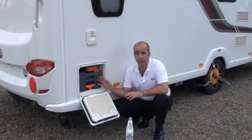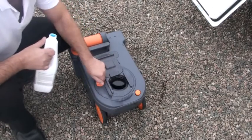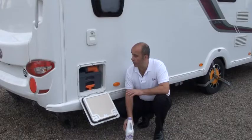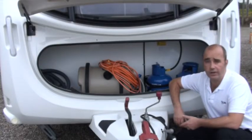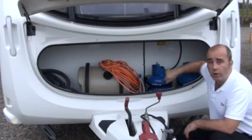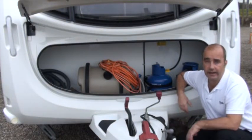When it comes to the toilet, if you have a cassette toilet, before laying up wash it out with hot soapy water, then use something like Thetford cassette tank cleaner to remove any calcium deposits that have been building up. For gas safety, switch your gas off after every trip, but if you're laying up for winter you want to disconnect your gas cylinder from the supply, because these are rubber hoses that will perish after a time — you don't want cracking and gas leaks.